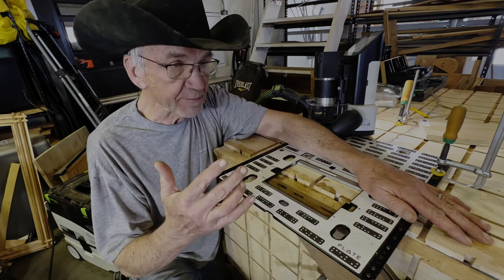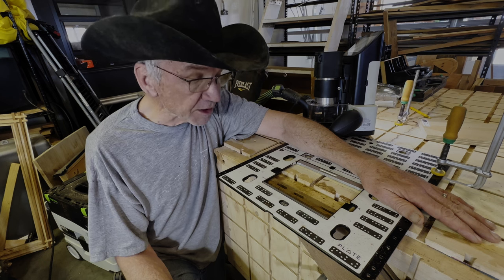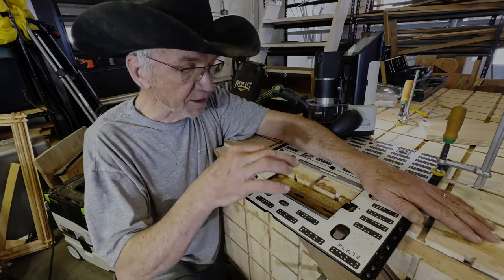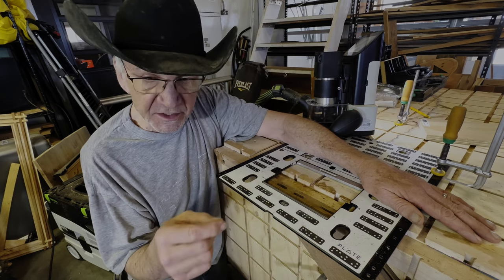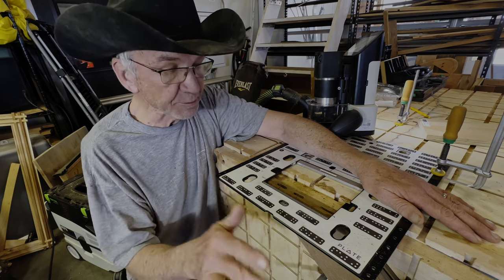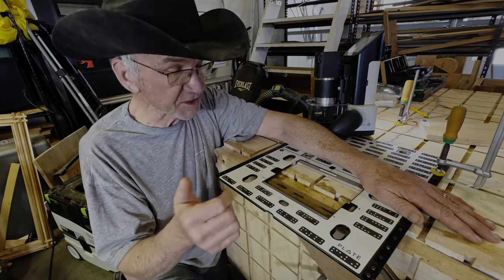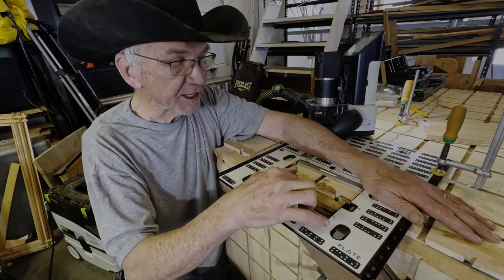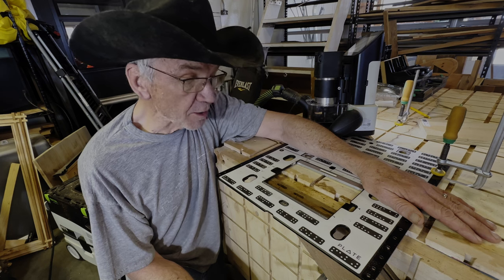With the first one I had to push maybe 20 or 30 button pushes, maybe more than that. It took a lot more time because every time I did a pass, I had to retract it, get my new depth, plunge it back in there. This one was much faster once I had those settings in AutoPass. And you saw me do it for the first time ever — I had no experience setting those AutoPass settings — and it still only took me a couple of minutes to set those. Once I said cut, it was a one button push and I just followed the path around. It automatically plunged it and kept plunging it deeper and deeper on each pass. It automatically did the finishing pass and then it even automatically retracted at the end when everything is done. So it was pretty impressive.